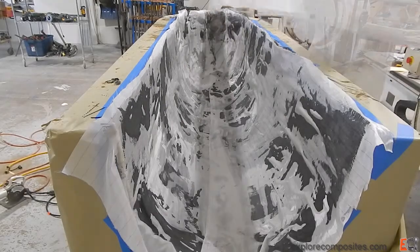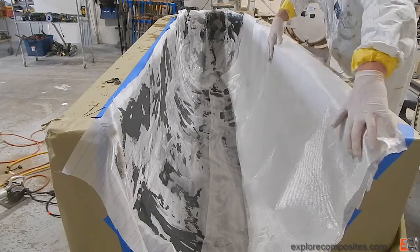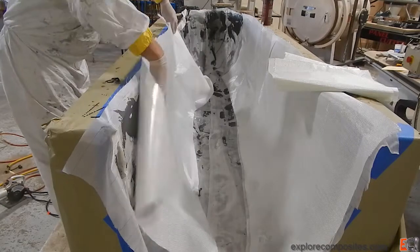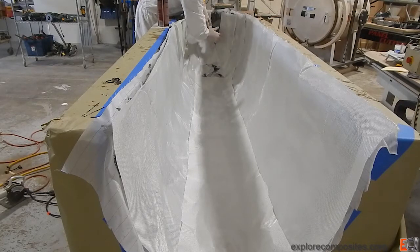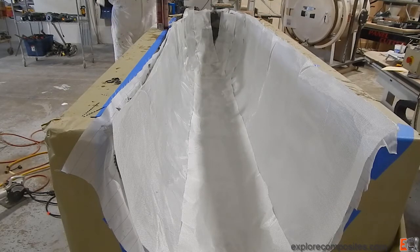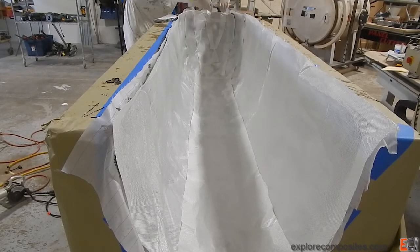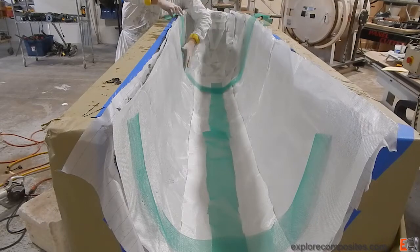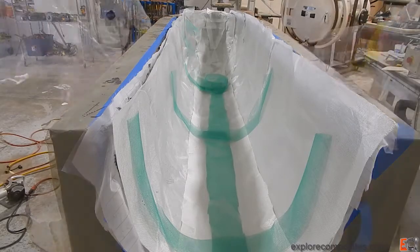Not an awful lot of resin soaking into that peel ply. Here comes the release film down — these have been pre-stuck together with the breather. The breather in this case is six ounce fiberglass cloth, which works nicely when you have very thin laminates, and there's a strip down the middle. I put this one layer down with release film and breather in one drop, patching it in and trying to have minimum overlaps in the release film because if the two layers are overlapped, there's nowhere for the resin to go. This is just a bit of infusion mesh — probably wishful thinking that I'll get enough bleed to make it matter, but it'll distribute vacuum.